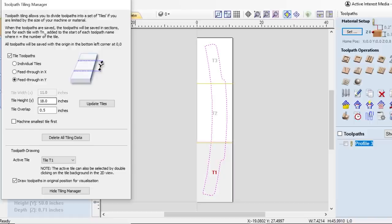I need to first select that I am in fact tiling, and it gives me a couple of selections: the tile height and the tile overlap — that's going to depend on the size of your machine and the size of the part. I'm choosing to make this part in three pieces, each 18 inches long. When using tiling, where each tile butts into another tile we need to have things overlap slightly so the router bit can pass into the next tile. If we don't, we'll end up with small round pieces of material where the bit can't quite cut that last bit. I've set the tile overlap at half an inch. You can see the tile manager has set up three tiles on screen.